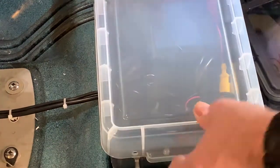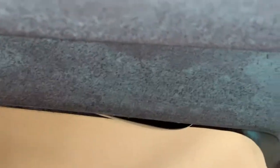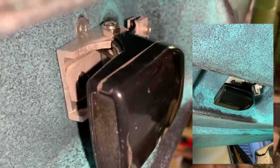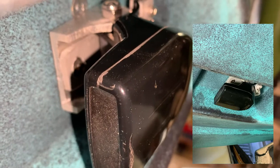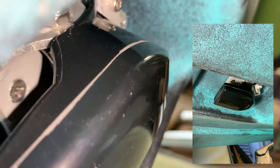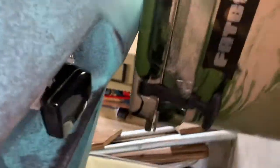That's how I've mounted the transducer. You can see the transducer is just a hair proud of the opening — that's because I used an aluminum bracket on mine. The way I showed you on the demo unit, using the PVC method, it will actually sit inside that area flush. On mine, the aluminum bracket is taking up space, making it stick down about a quarter inch further. With the PVC plastic disc approach the piece will be right flush against the deck.